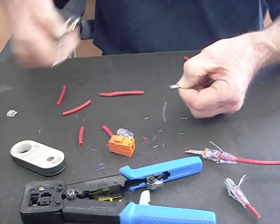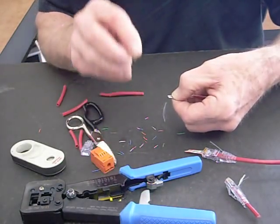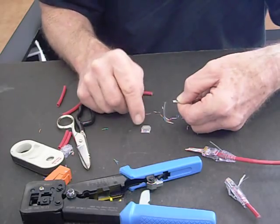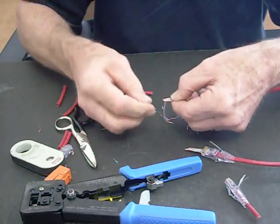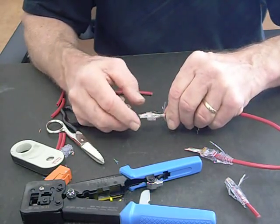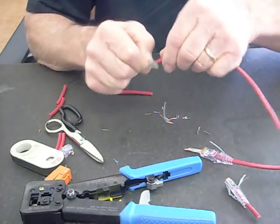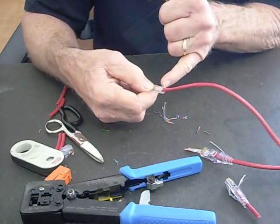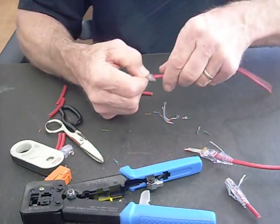Now we're going to trim this. What we have here is the wire guide bar — a little piece. You can see a little better sitting here. It has the color chart on it, and of course it's reversed from what a connector would be, so I'm going to flip this. Then we're going to slide this in — it's perforated on top so it can take contacts. We're sliding this on — see the wires coming through, just like on an Easy RJ45. I'm pulling it, stretching it so that the twists are up right at the point of termination, right here — so very high performance.